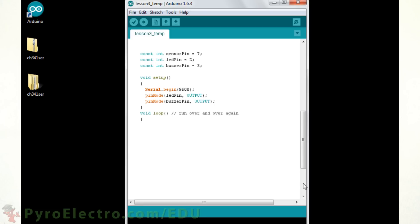In the loop function we will need to do several things. First we will use the Arduino Nano's analog to digital voltage converter and read the analog voltage from the temperature sensor. This will give us a 1024 bit digital equivalent value of the analog voltage. With that value we will need to translate it back into the decimal value of the analog voltage. Since we are using a plus 5 volt supply, we multiply by 5, and since the digital equivalent value used 1024 bits, we must divide by 1024. At this point we have the raw voltage stored.